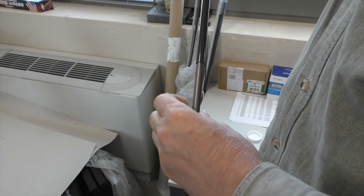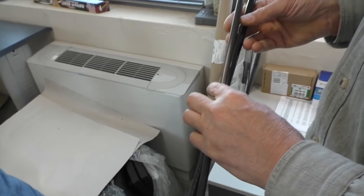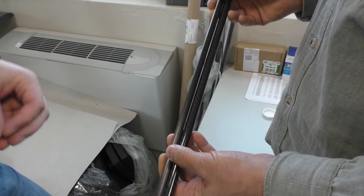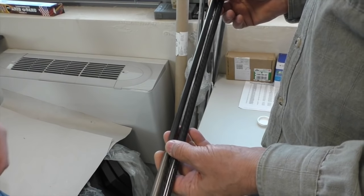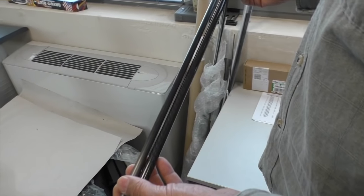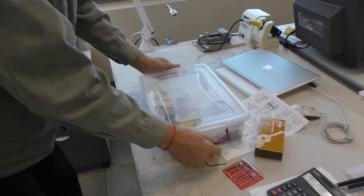And then what do you put in between those two? They just sit in there together, and there is some glue and another damping compound in between. And there is then Teflon tubing, because this is conductive, so it prevents the buildup of static. We need a Teflon tubing to insulate the internal wires, in case this creates any potential. So how many parts go inside one of those donuts?